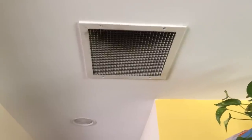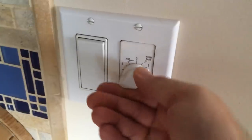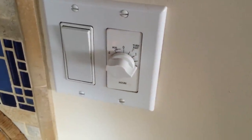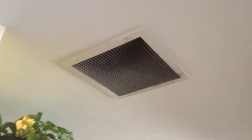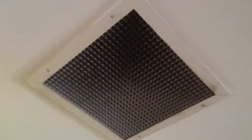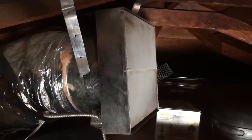I first bought one, and within a year I upgraded to three because I was so happy with the system. I have two in my house and an additional one in the back, which I use as an office. I run them all separately on timers, and they were easy to install — basically all you have to do is cut a hole in your drywall or sheetrock in the ceiling, screw in the grille, and attach the actual fan against the rafters in the attic. I installed them all myself, but you can also hire a handyman or electrician to do the hookup.